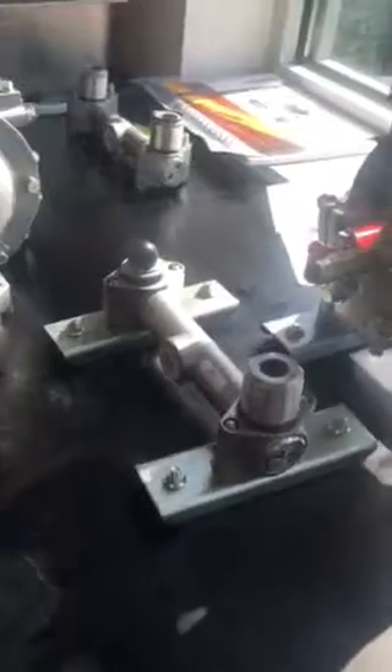Maintenance on the air valve itself — this is 316 stainless steel, so you're never really going to wear that. That's your seal. So when the pump sucks, it lifts that ball, the fluid comes in, and then this little button gets pushed and it switches to the other side.